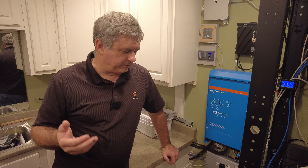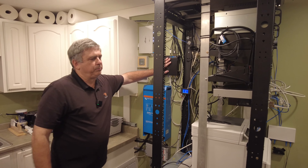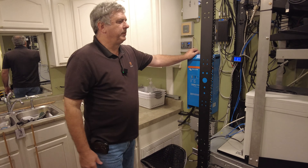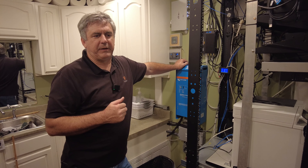Then the Motorola guys learned of it, and they wanted their server, their SAN storage area network, repeaters, Wi-Fi, cradle point, cellular modems, and Starlink backed up. So all that stuff got backed up, and we ended up with about a thousand watt dissipated load. Those two batteries only gave us about two and a half hours of run time, so we started thinking about that.